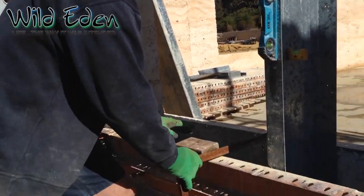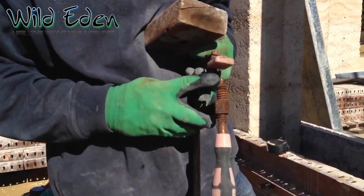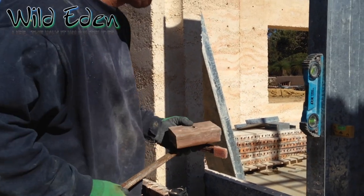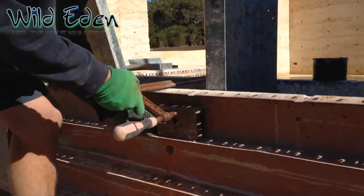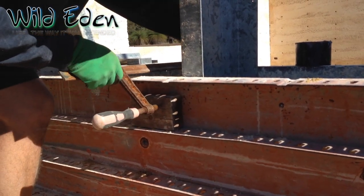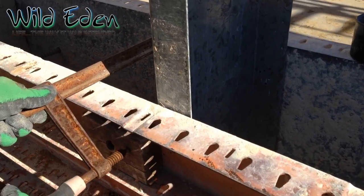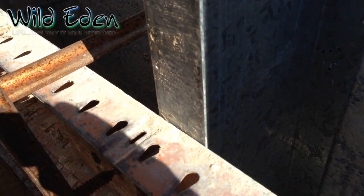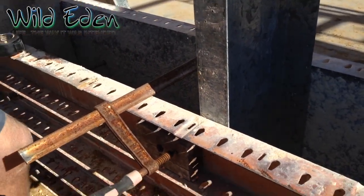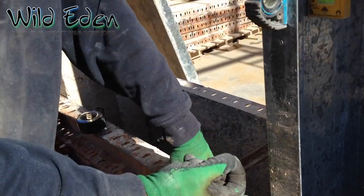This is what we do — we have an F-clamp. We take that little bit off so it's just left with that little bubble, and we put the F-clamp over the back into a piece of wood just like this. As you tighten it, the gap gets smaller. Because we're doing it into wood it's not slipping everywhere — if we had a pad on there it would slip and be very difficult. Now we've got no gap so we can put a tech screw through very easily without snapping it.